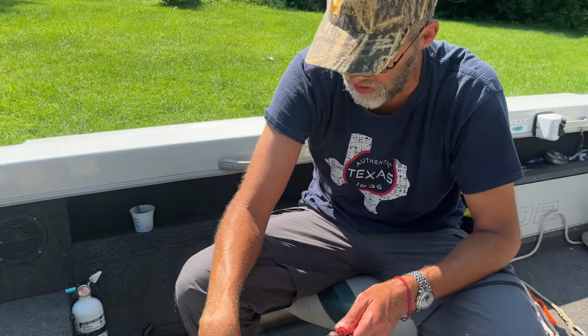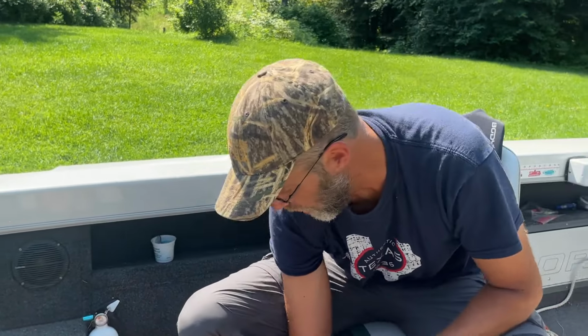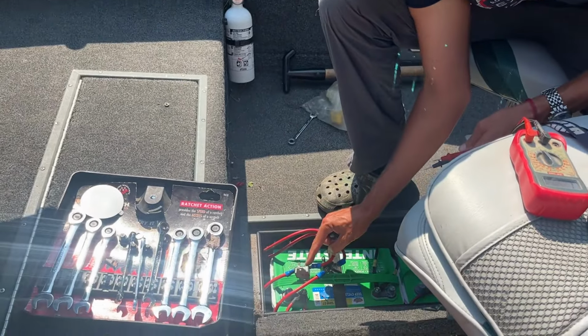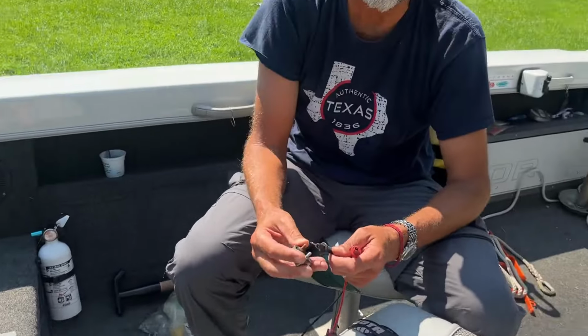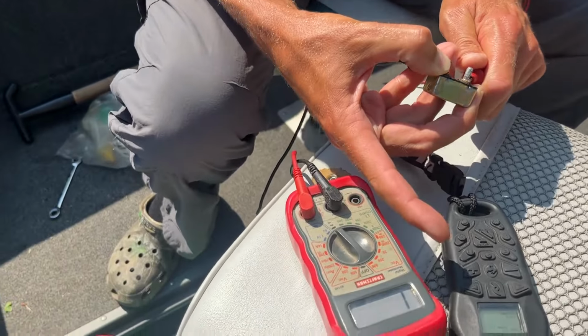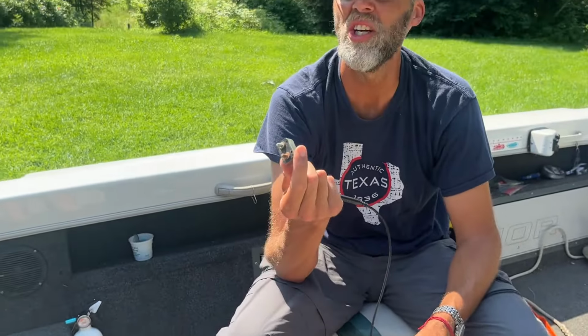Showing no resistance. Well, what happened was the one that goes to the trolling motor, this one right here, I put it across there and I didn't have that. So then I checked, so if you could hear, there's no tone and the setting stays right there on 1. So I replaced this. And fortunately I had an extra one of these around.